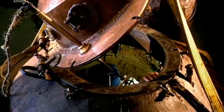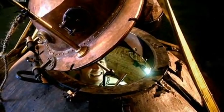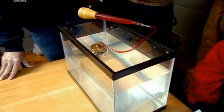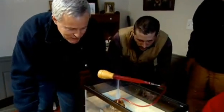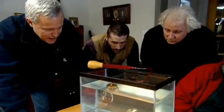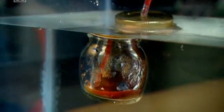Matt is ready to take the turtle underwater to see how easily he can control its buoyancy. Lou has a warning. Ballasting pumps. Now this is just a little demonstration about what I think we'll be seeing and how sensitive it's going to be to take on water and be able to pump it back out again. As you can see, the turtle, our simulated turtle here, is just bobbing on the surface. Assuming we've put in the right amount of lead for fixed ballast, we're going to have to bring on an additional about 300 pounds of water for this to submerge.